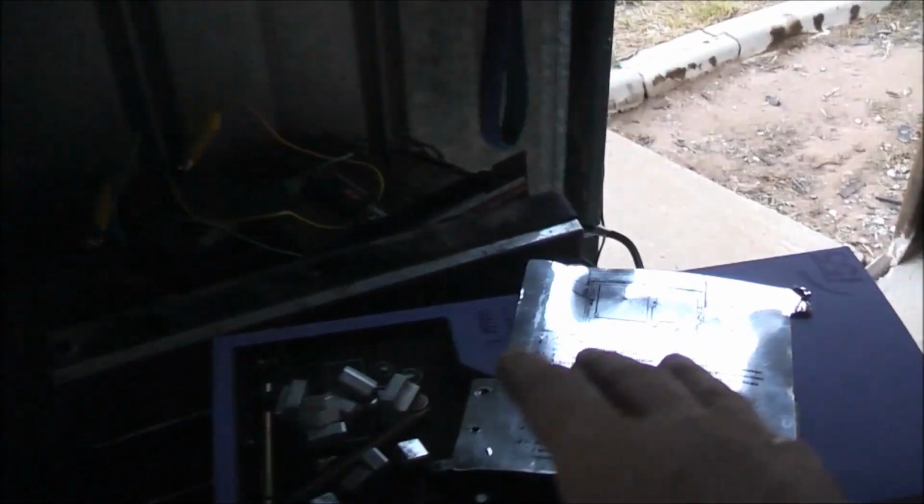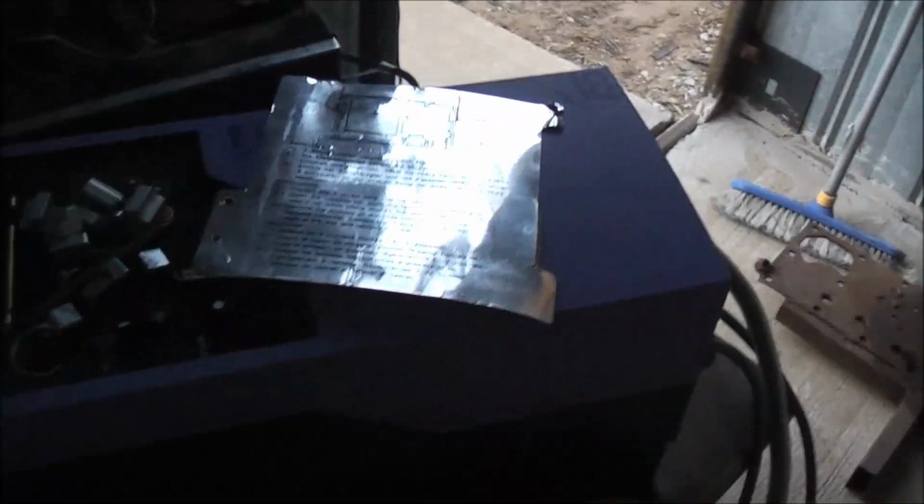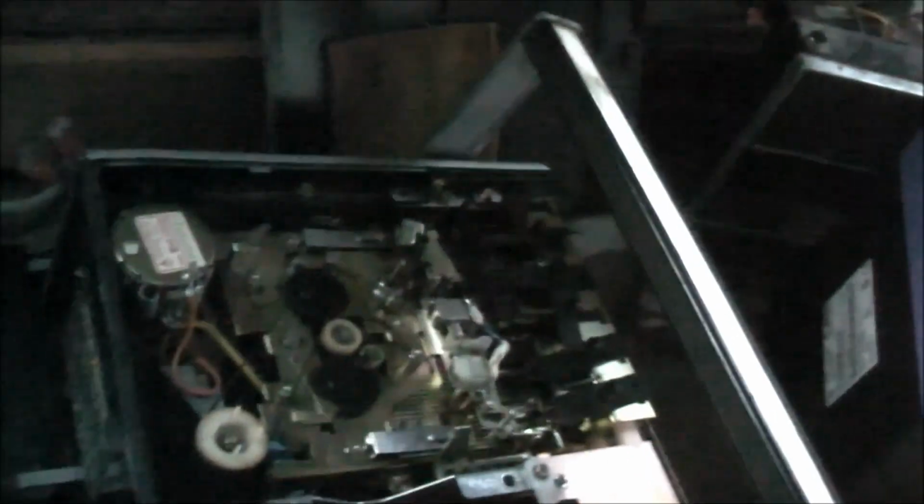Yeah, it's a bit touchy because it's broken. There you go. There's a plastic slider inside that metal handle. That metal part goes in the plastic slider. Underneath the plastic slider there's a carbon part for the brush and the slide track. Well, that plastic part that holds that metal tab on is broken, so I'll keep an eye out. I've got some old vintage TV parts in storage, which I think has a slide pot just like that somewhere. Hopefully it's the same value. It should bolt straight on there if it's the same size.